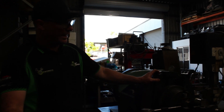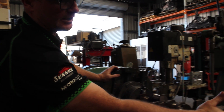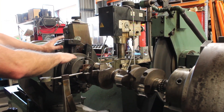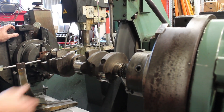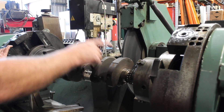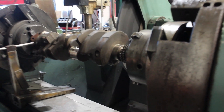When setting up on mains, you want to set up off the furthest edges of the crankshaft, or preferably the seal area and the snout at the front. That gives you the perfect centerline to then grind your mains to. This one we're going to set up here in the seal. This crank is actually out of a marine application, so it has a dog drive on the front that would go into a boat. Rather than remove that — we know the crank's dead straight — we're going to set up off the very front edge of this main journal to keep everything in line.